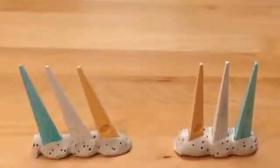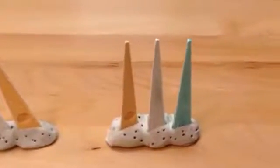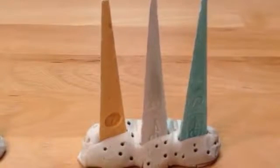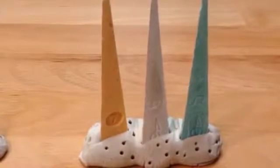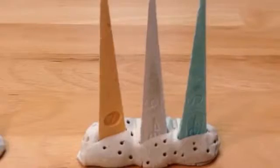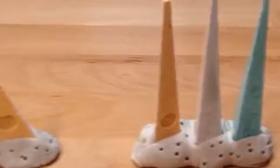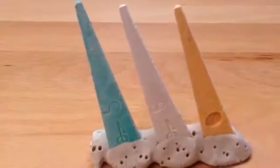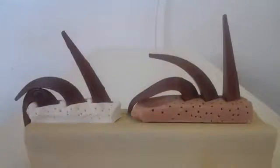It's really important to make sure that the angle is correct, otherwise you could get inaccurate results. This cone pack is far too vertical — these cones are far too upright and this is not going to give you accurate results in the kiln. Here's an example of cones at the correct angle. This photo shows two cone packs that were fired next to one another in the same firing: the one on the left had cones that started out in the correct position, and the one on the right they were a little bit too upright — and you can see that it looks like drastically different results.